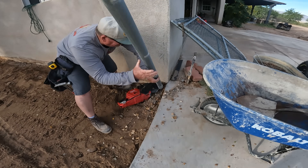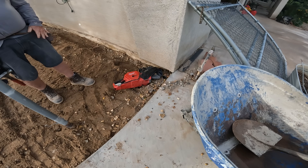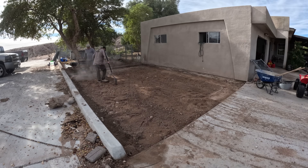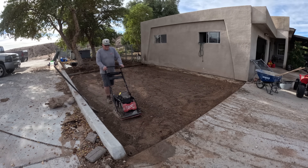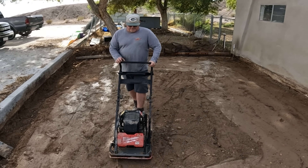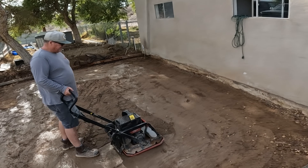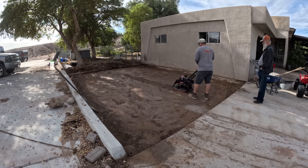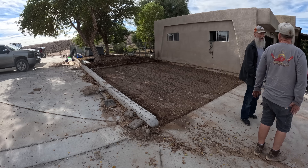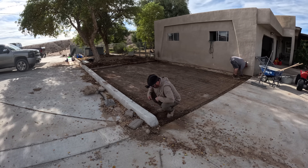There's an existing fence post that had to be removed. It had a massive footing on it, so we left the footing intact because the front entrance of the carport doesn't have a deep footing — only the rear and two sides. We did go a little deeper on everything though. We went about five inches deep on the whole package, then recessed around the entire perimeter another 10 to 12 inches deep for the perimeter footing all the way around. We also dropped some rebar in there — two number three rebars around the perimeter.